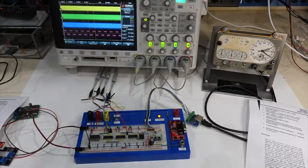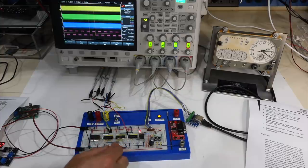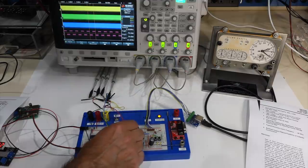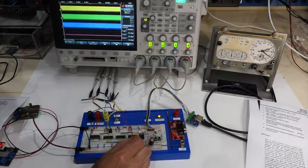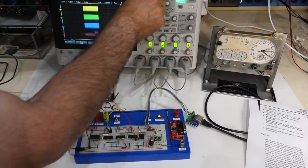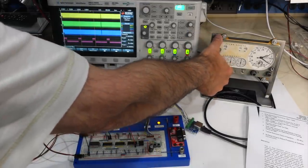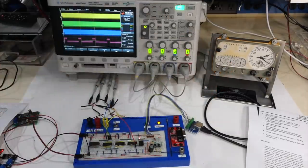And in the last circuit, I use it in BCD count, so I have the divide by two first and the quinary part afterwards. So it gives me nice and short pulses. I take this as an advantage that it's not symmetric. So here you go. This is what feeds the amplifier and turns on the clock.